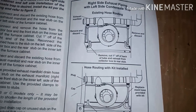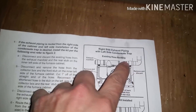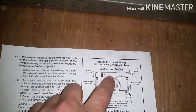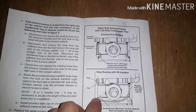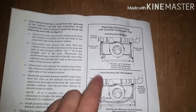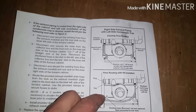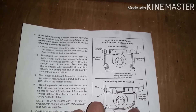Here's another example showing how it currently is — these are capped. The exhaust, instead of running all the way over and out, does fall in there and collect. So we'll take off this cap. You're supposed to take off the forward one, go into the exchanger, shorten it, put it in the second hole closest to the exchanger, and run the new hose they provide to here — then just leave this one as is.